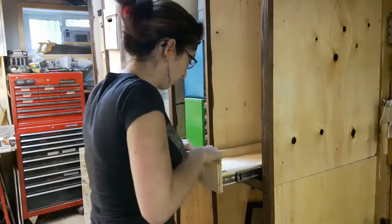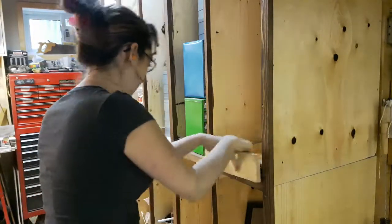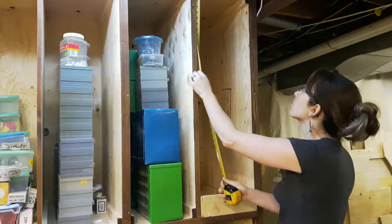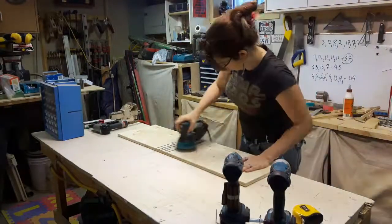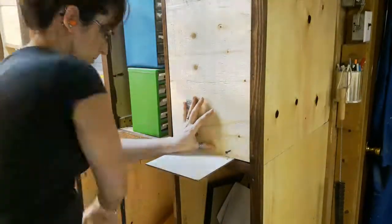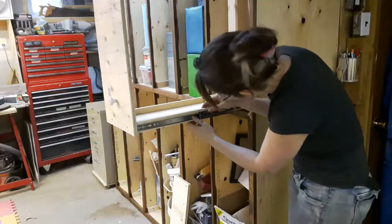And then of course a practice test, and a little bit of excitement at just how beautifully this is working. Once I was done with my testing, I started on with the rest of the drawer, starting with the front, which was actually going to be recessed into the cavity. Because the main real front is actually going to go on top of this — this is just for structural, so I have something to attach my shelves to. I put my spacer in so that it would be able to clear the bottom of the cabinet nicely, going in and out without any binding issues. The back was basically the same sort of idea, but I used a much thinner piece of wood, because this is going to be more than strong enough, and it just saves a bit of material and a bit of weight.